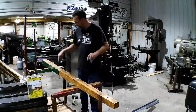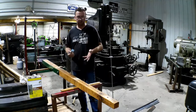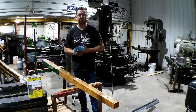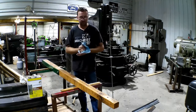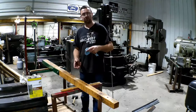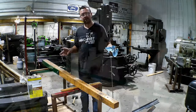We got them drilled. Drilling through this white oak treated with boiled linseed oil — it gets very dense and hard to drill when you soak that much oil into it. I've soaked probably a couple of quarts into this thing already, so it's well preserved and should last my lifetime. Just once in a while it needs another coat — no big deal. We'll go ahead and get the tongue back on there, slide the threaded rod through, put the square nuts on, and we'll be done.